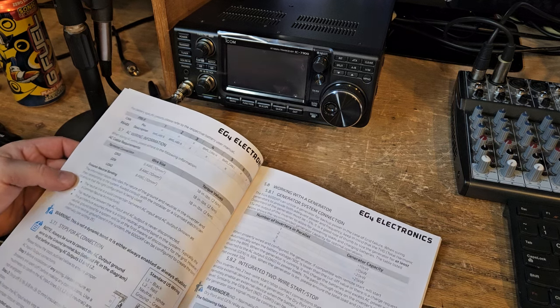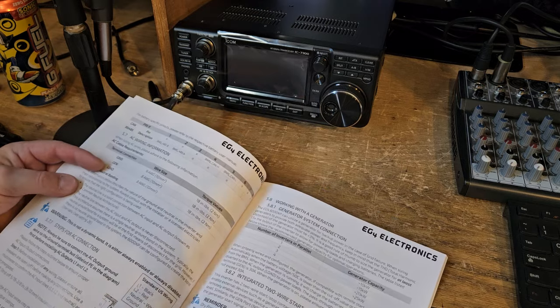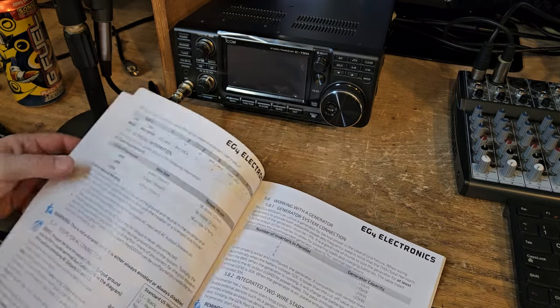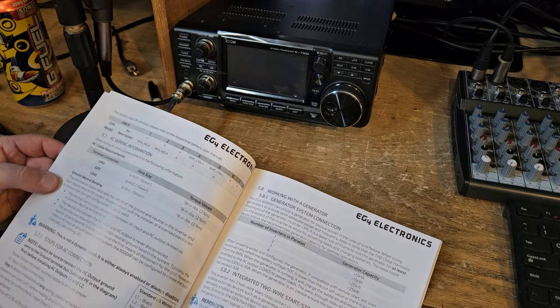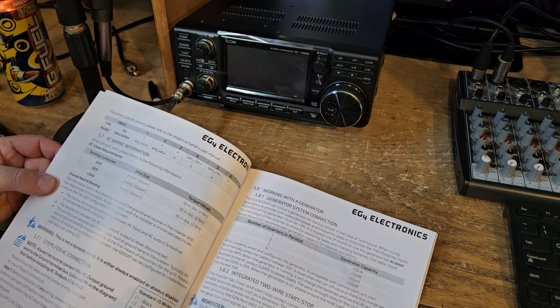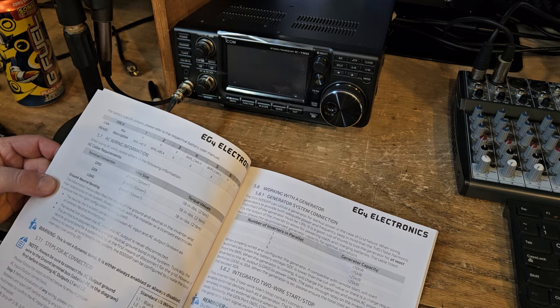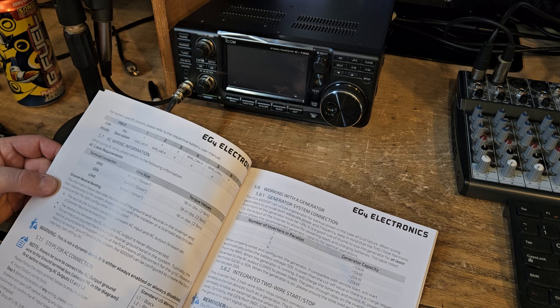I can see I'm not going to be able to get this hooked up today. It's just not going to happen, because I'm going to have to run all sorts of stuff to it. It's already 3:39. We're at our peak hour for solar, but it drops quite quickly around 5. AC wiring information. They want 8-gauge wire for generator, for grid, for load.